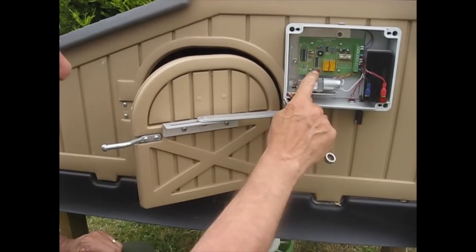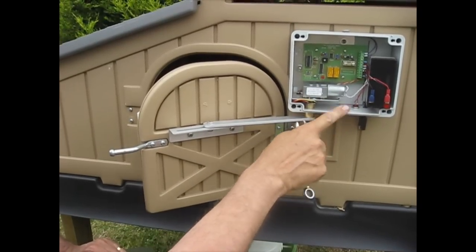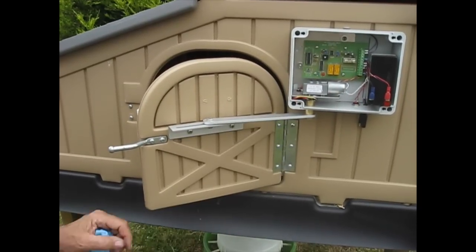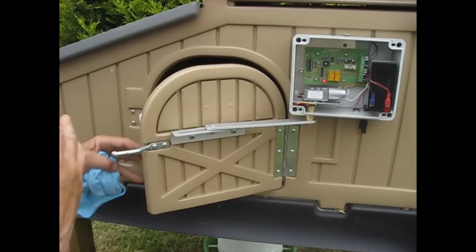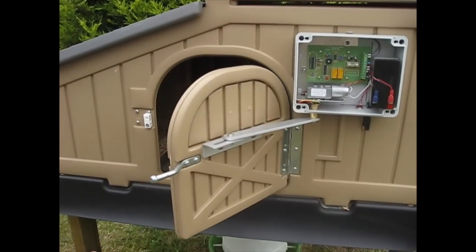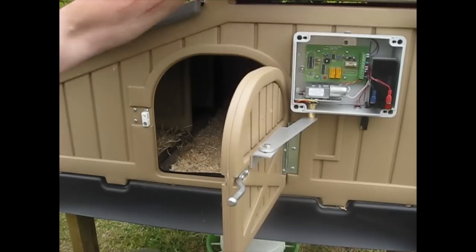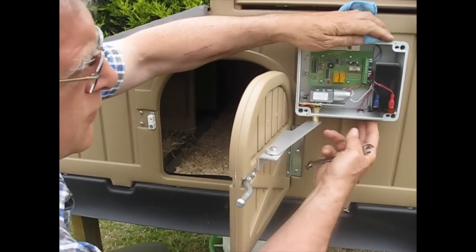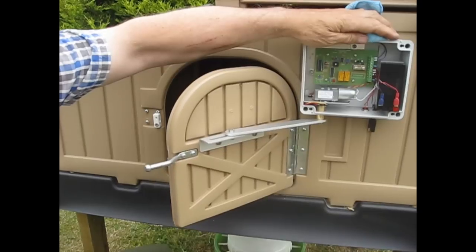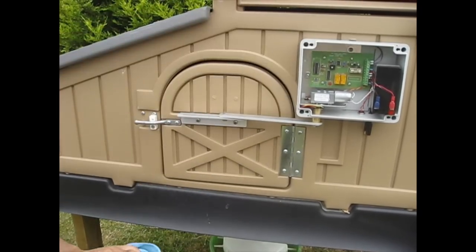As you can see, the LED is warning you that there's been a fault — something's happened. The LED is on the printed circuit board; it may be there or mounted underneath. When you've cleared the obstruction, just press the reset button. As it's light it goes into the mode where it opens again. And if it was dark, as you can see the LED light is now no longer on — the fault's cleared and the door closes in the normal way.